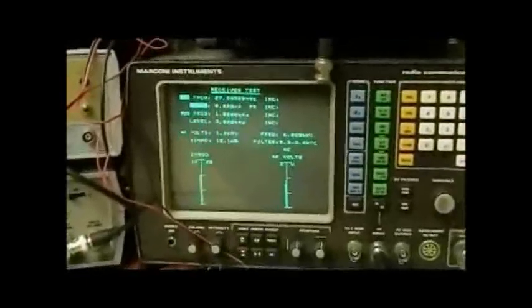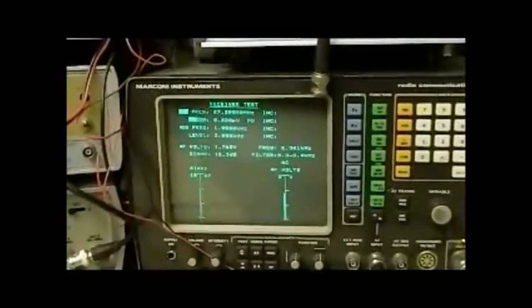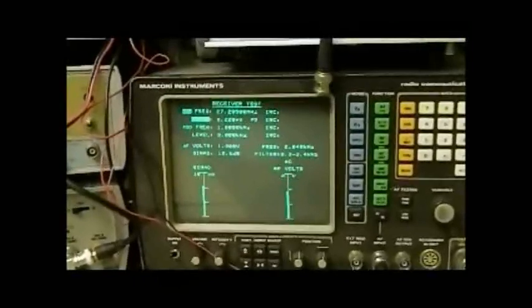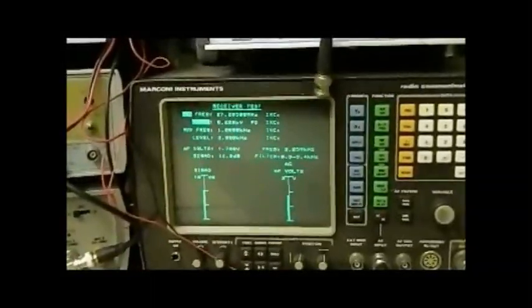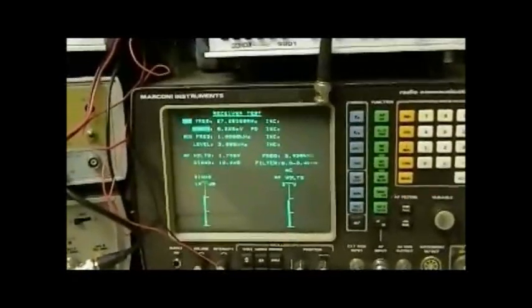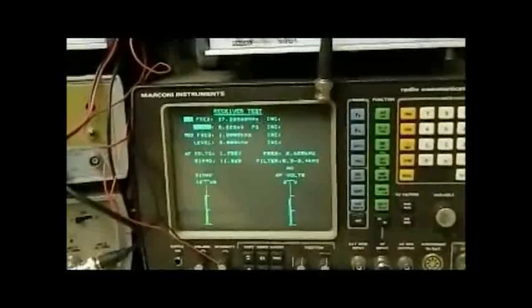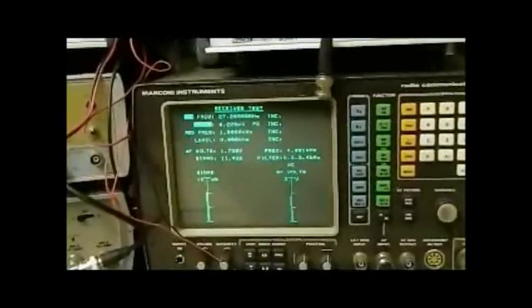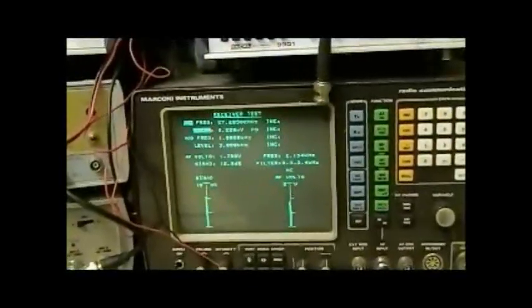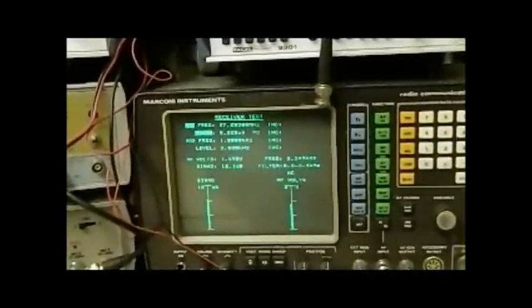I did notice that both the export manuals for the Uniden and for the Cybernet chassis probably use signal-to-noise. But really, if you've got either radio and you use the SINAD method, you're going to get an idea of whether the receiver is still working properly or not, and whether it's on frequency and that sort of thing.